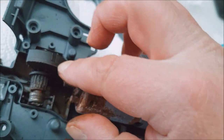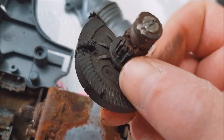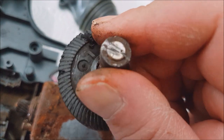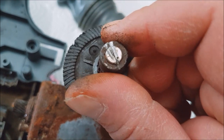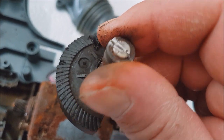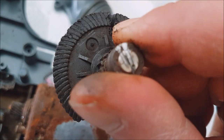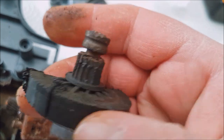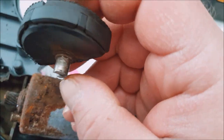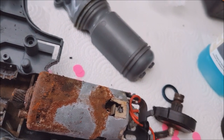This is the pinion wheel, and as you can see it's plastic. This plastic has been machined by the steel pinion, leaving almost no usable tooth volume remaining. Any pinion would slide on it. It had two bearings on each side, of about the same quality as the others, and they were massively seized.